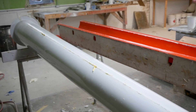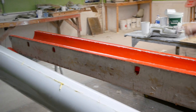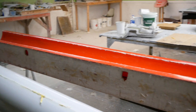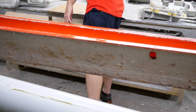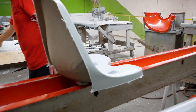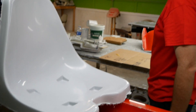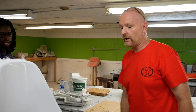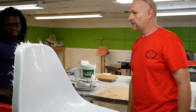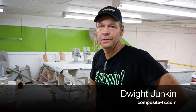That is an untrimmed tail boom — you'll see in one of the next stations the trimmed version as they're set up and matched with airframes. Up here all of the little components are made. For instance, a seat comes off a seat tool, and any of the other 35-plus parts that go into the airframe are made in this area. And what are they made out of? It's a composite material — a vinyl ester matrix with e-glass.